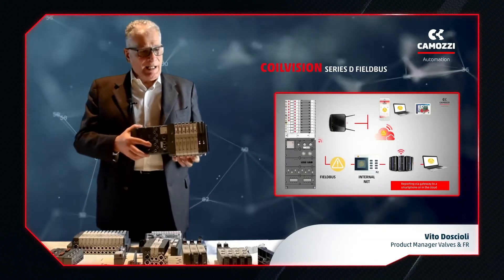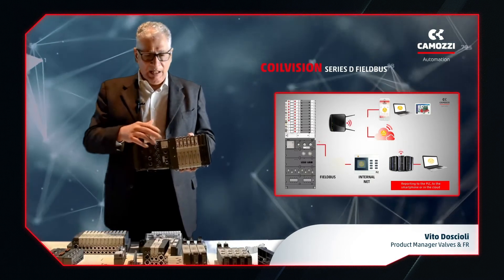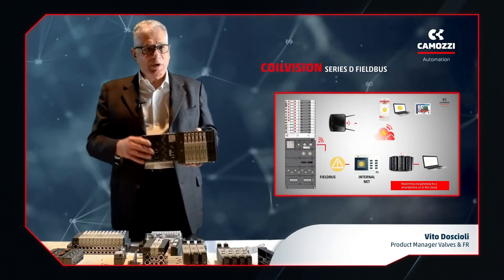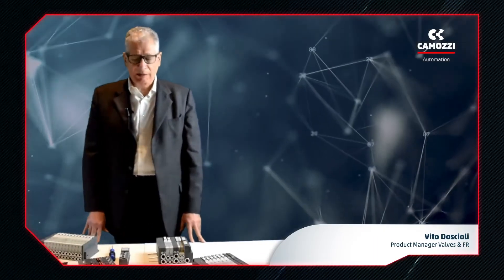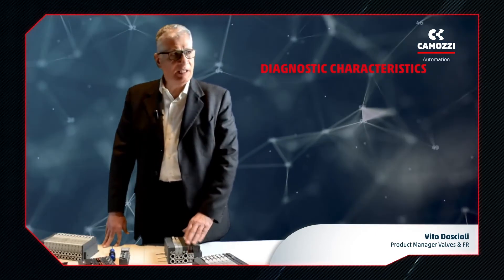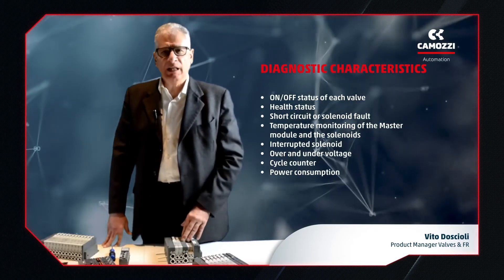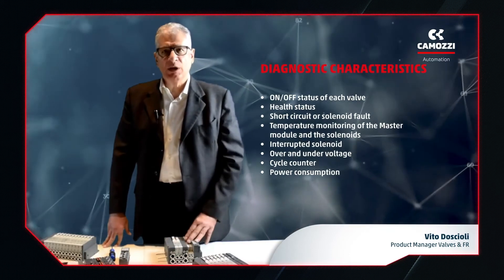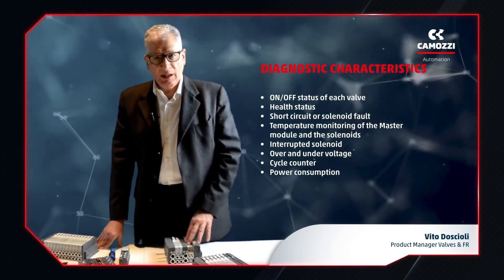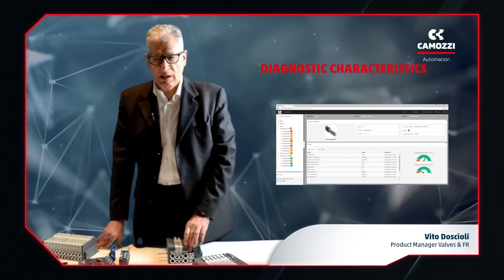With these islands we have yet another function: WLAN. So, instead of communicating with the PLC through a cable, we can transmit through Wi-Fi to a smartphone, PC, or touchscreen. All the information gathered by the CoilVision system can be transferred to the PLC or sent through WLAN to an IIoT system and then transferred to the cloud or onto a server to be stored and managed. This information can be viewed through UVIX software, which is available on our site for free.